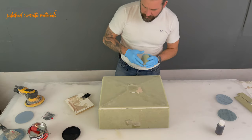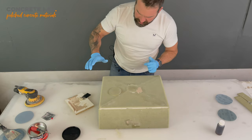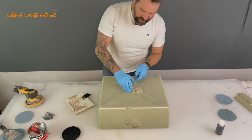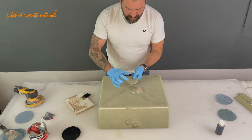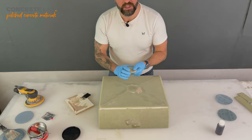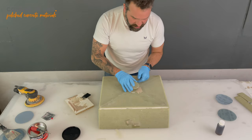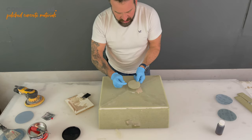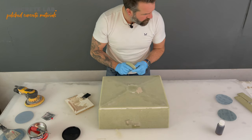After that, what we're going to do, all those Hawkeyes amongst you have probably noticed there's another disc there. Now, this disc is going to sit on top of there. And the reason for that is that when you have a sink waste, it always sits just a little bit deeper within the sink itself so that the water can drain into that waste. Obviously, this is the negative of it. So this will create a depression in the base of the sink so that the water will drain to that point. So we'll do that next.